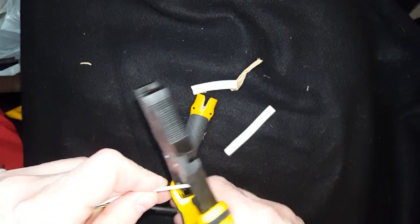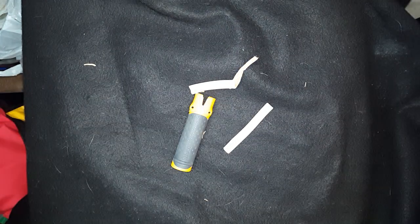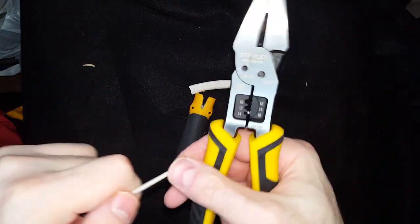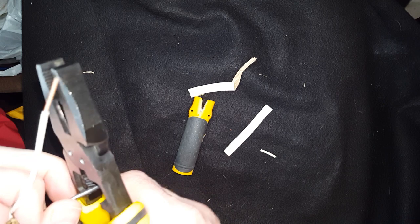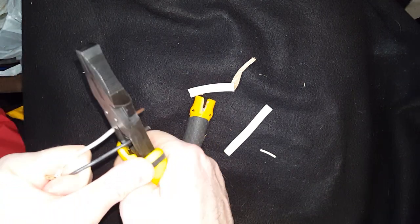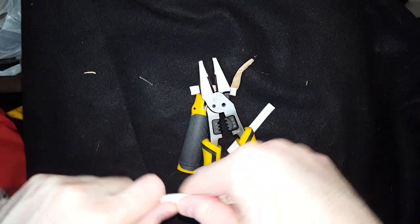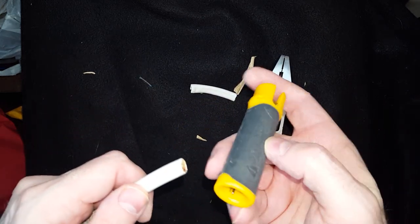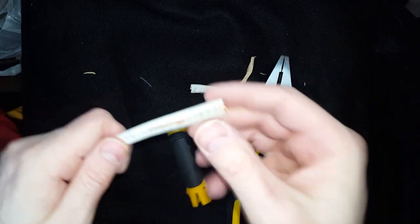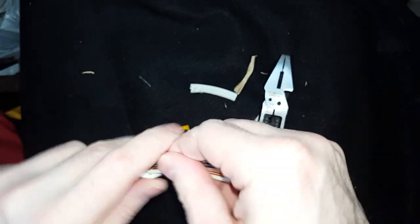This particular one is also a wire stripper. Put it in the 14 gauge slot — this one is a 14 gauge wire. This is just for demonstration purposes: I'm going to cut both sides of it and then use the pliers to twist together one of the conductors.